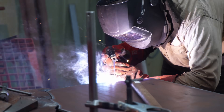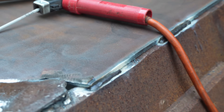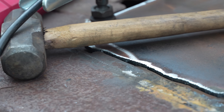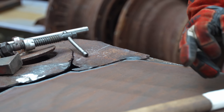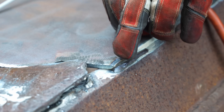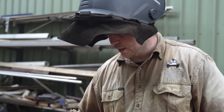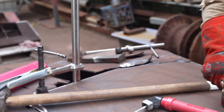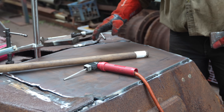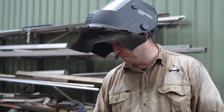You can see what I've done — I've put this patch plate in. Now I just need to fill in all these little pieces because we didn't have a sheet big enough. All of this will get filled in here and here, and then this will get pulled down. It's not really touching there or here, so I'll dog them down and tack them on the corners, fill these extra bits in, and then that piece is done. Then we'll trace out where the actual hole would go and cut that. Then we'll put our additional piece on and that will be that done.